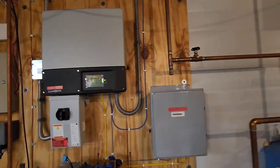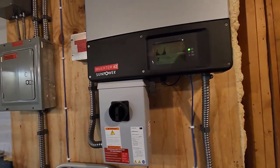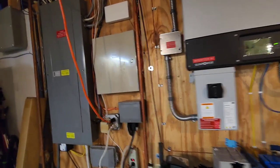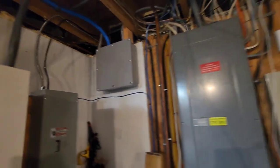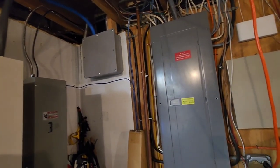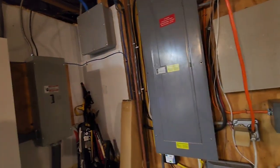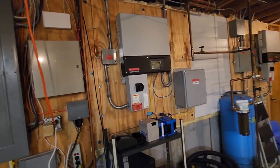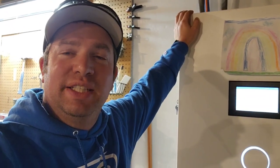Another problem: this system is AC-coupled with two SunPower SMA inverters. One of the glitches was that the PV CTs — which are up in this box here — got flipped in the computer software, though not in real life. So it was reading the production wrong and then not charging when it needed to. Just one more thing that goes wrong.